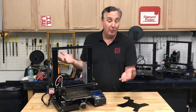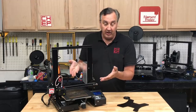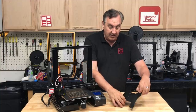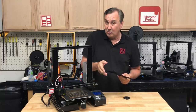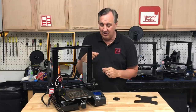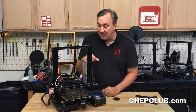Three adjustment points instead of four — it works and I got it to level pretty well. Is it worth it? Well that's your call. There are some nice features though — you can add a camera or a handle and it's already drilled for that. This also has holes so it can fit an Ender 3 Pro with the wider base and also a CR20, so it can be used on other machines. Now if your base is bent — sometimes they get bent in shipping — this is one way to replace it and get a three point leveling system at the same time. But losing one extra knob, I don't know if it's that big a deal. And that spring being compressed because of the bracket — I think they should have supplied a shorter, stiffer spring so you could still get travel without crushing it. So I think it's a decent setup.